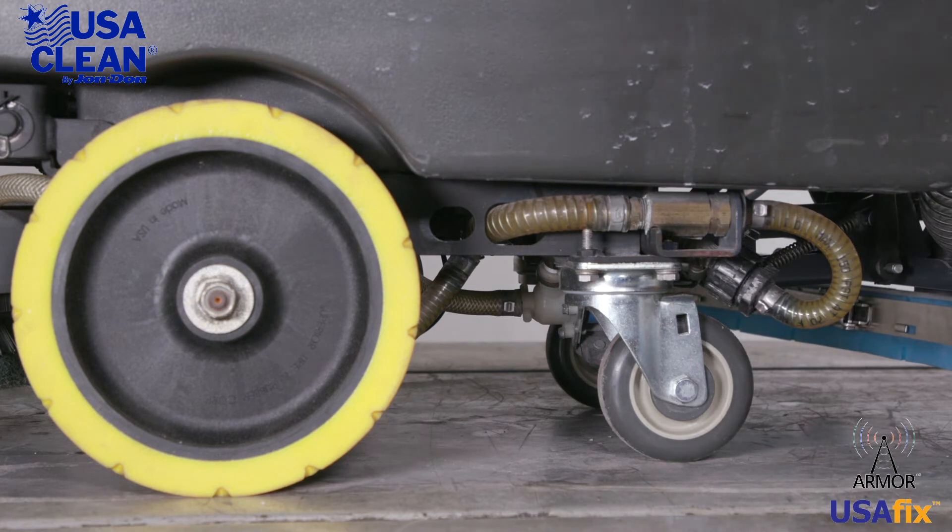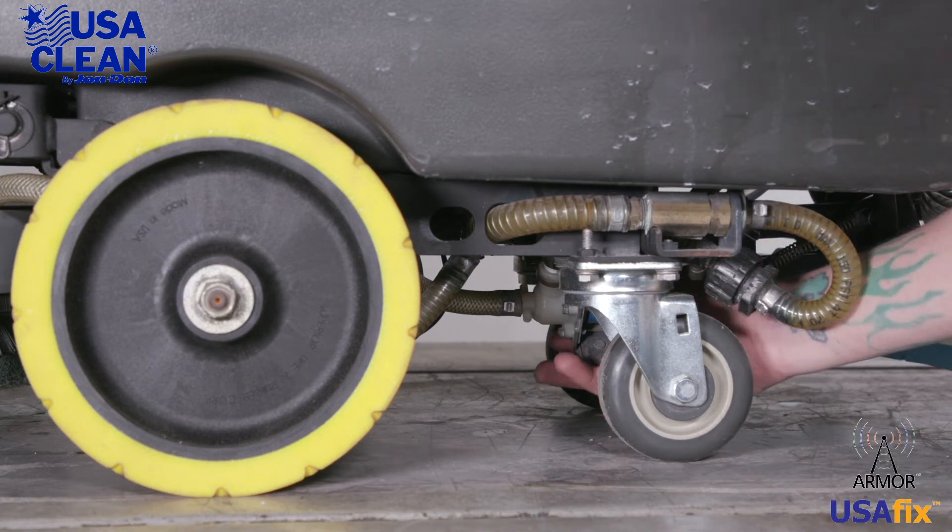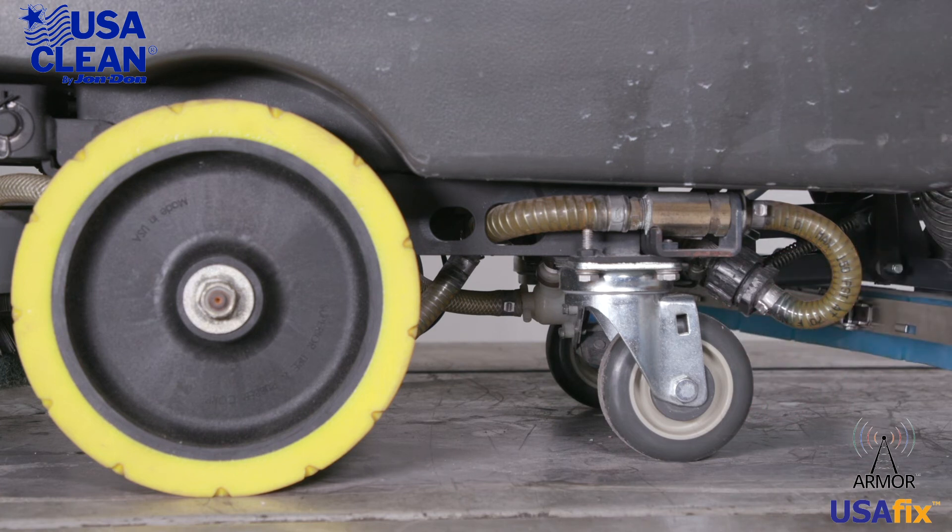Right here is your open and closed ball valve — make sure that that's operable. Take a look at your caster wheels; make sure that those have no flat spots and they're not broken in any way. Back behind here is your solenoid valve — make sure that that's not damaged and your wires are not unplugged. And then go ahead and take a look at your drive wheel; make sure that your drive wheel doesn't have flat spots and it's not broken.